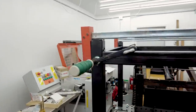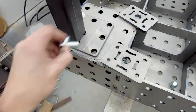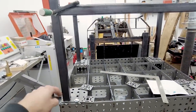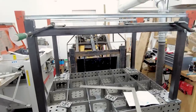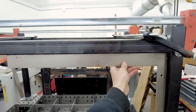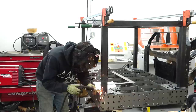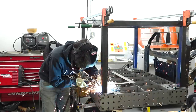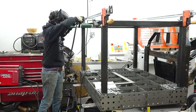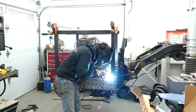I've got the legs all loosely clamped up to make sure everything is fully seated. I dropped some hardware into the holes to make sure those plates will be in the right spot so the hardware can go back in after this is done. Everything is looking nice and square — checking that now — it squared up perfectly. So now I'm going to tack all of these pieces together: all the legs, all the cross members, and those plates. Once tacked I can pull the clamps and then fully weld all the connections.